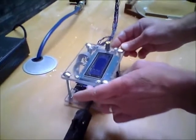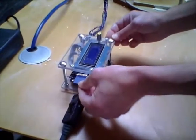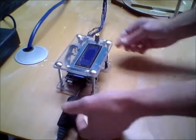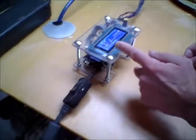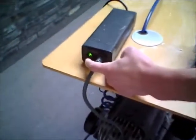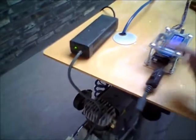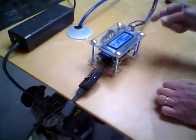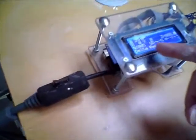So our file that's on the SD card goes into that slot there — and it was upside down. Power on. Now if for some reason it doesn't power up, check that this hasn't gone to red. If it has gone to red, then at the wall pull off and then just re-power up, and that comes to green. So your power pack needs to be green and then this will power up. The first screen is basically all your settings — 'Delta Ready'.